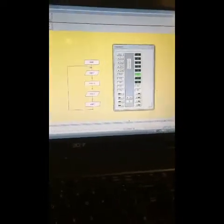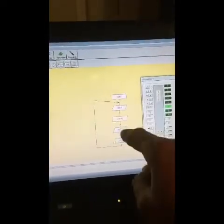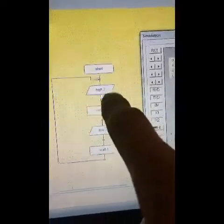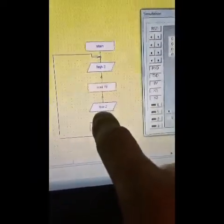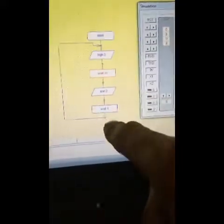This is the actual programming emulator. When you start up it gives you an option to select which type of chip it is — the details are on the downloadable data sheets — but if you get the wrong chip it will tell you and show you which the right one is. I've gone for the flowchart option, which is the easy one; you can type in Basic syntax if you want, but the flowchart does the same job. It takes the commands, converts them to Basic, then converts that into the language the chip understands. In my program I have a start, an output box telling pin 2 to go high, then wait 10 seconds, then pin 2 goes low, then wait one second and go back to the start.